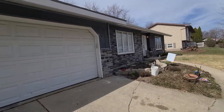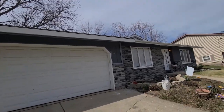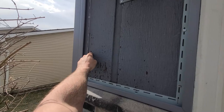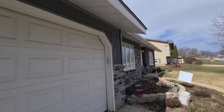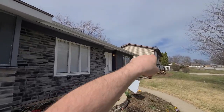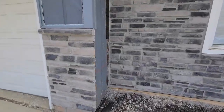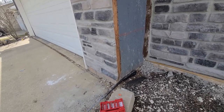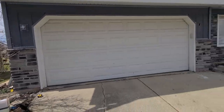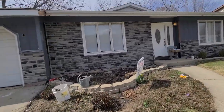You can see we really needed a laser since they came through and put on this stone. We're going to put our left side on, figure out where it goes, make a mark, and it should be the same over there - I double checked, that's what that mark was on the brick. I had the laser set up from where we started on the other end, landed on this end, came across the front, put my mark with the laser, got the bottom snapped, and everything matched up - within about a 16th of an inch.